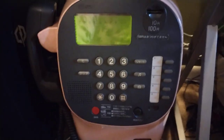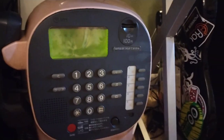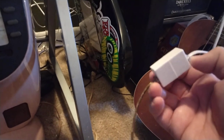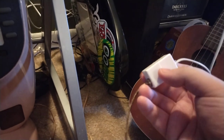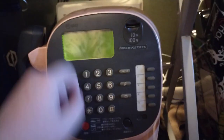There are a couple of things you need to know before you can make this work. Number one: these phones are expecting to be plugged into something with reverse polarity. There are a few ways to achieve this. If you plug it into a PBX that is reverse polarity by default, everything will work fine. Most people don't have that. What I did was build an adapter — it's just two phone jacks on either end, and on the inside I reversed the red and green wires so the polarity gets reversed. We plug the phone into one end, and the other end goes up to my ATA. Without a reverse polarity phone line, this will not work.